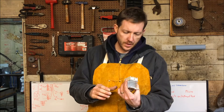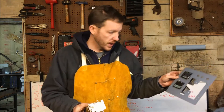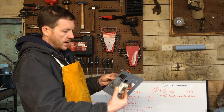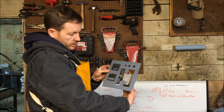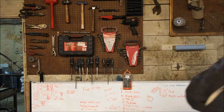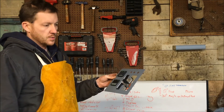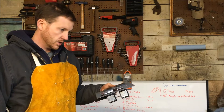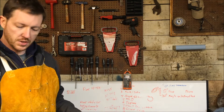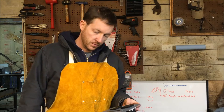I'm going to put some thermal paste on this and mount it that way. I also redesigned the control panel so I cut out the area around this heat sink, and I'm going to mount a computer fan to the front of it to get some air circulating and help cool it. Hopefully between almost doubling the capacity of the relay, using thermal paste, and a fan, we'll be able to keep this thing cool and safe.